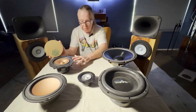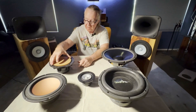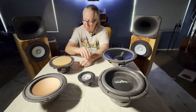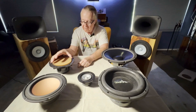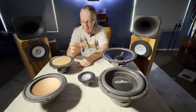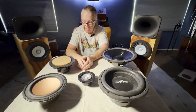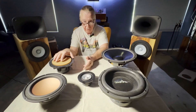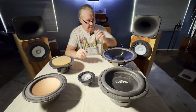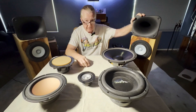Also a Mark Audio driver over here — six inches. No problem, it still covers the entire width. It goes all the way out to two kilohertz, maybe a little bit beyond that. That's safe because our crossover is right around two kilohertz, so we don't have any beaming occurring at the crossover point.